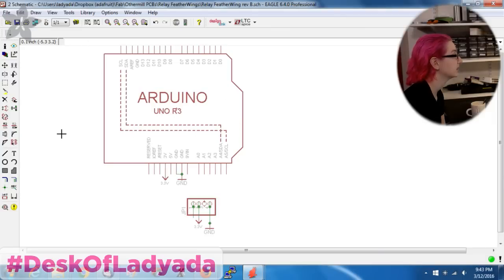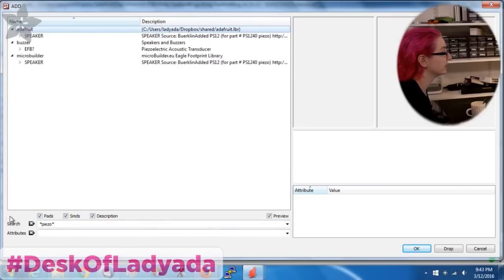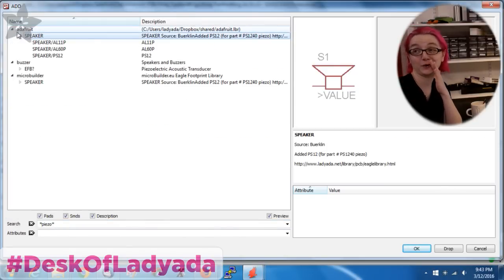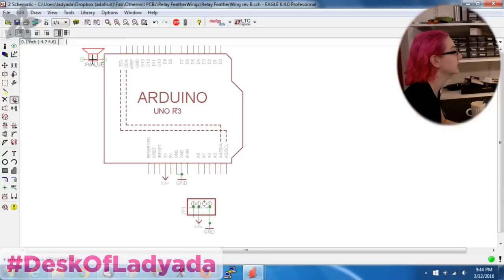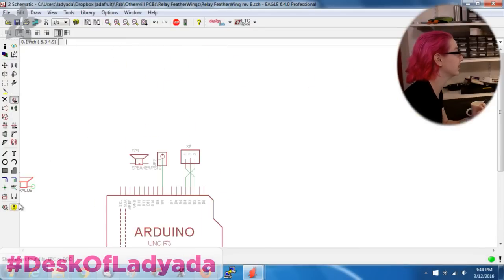Do you want to answer questions while I do this? Yeah, sure. How do you handle doing vias with the mill, or do you just avoid using vias for simple prototypes? I just avoid doing vias. If you've noticed, I'm routing lines so that they're really large. You can totally do vias, but you have to solder a wire through, and it's a little annoying. So I design things with large enough parts that I don't need vias.